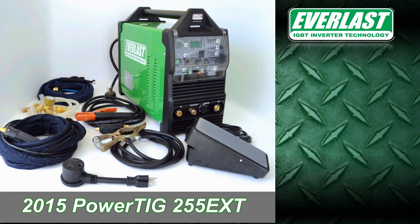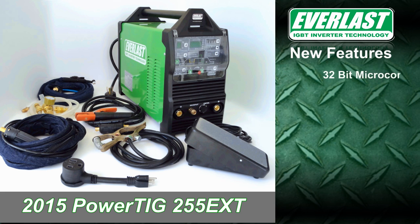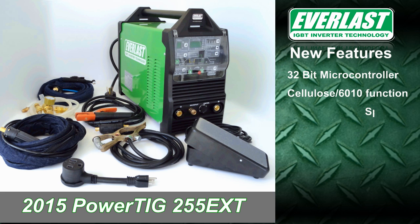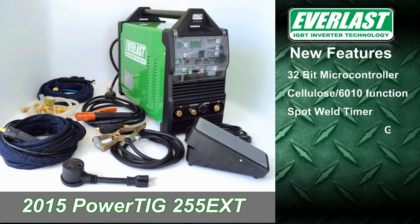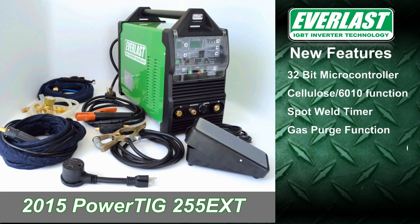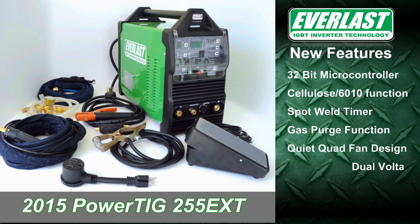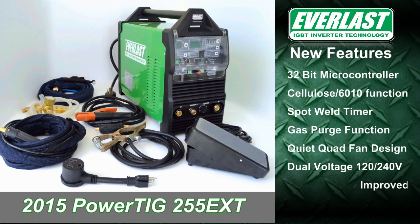The 2015 255EXT includes the following important new features: a 32-bit digital microcontroller, a cellulose 6010 function for improved arc performance, a new spot weld timer control, a new gas purge function, a new quad fan quiet running design, new dual voltage operation, and an improved panel design for more intuitive operation.